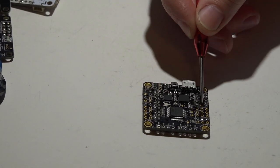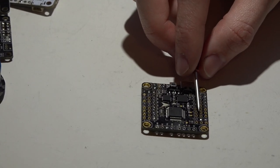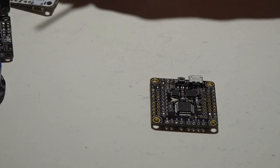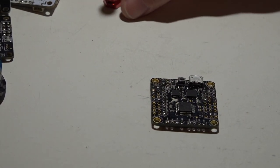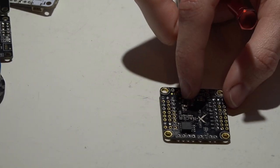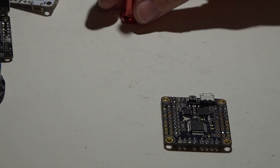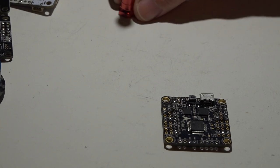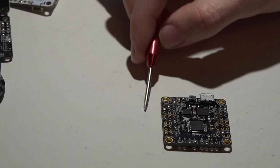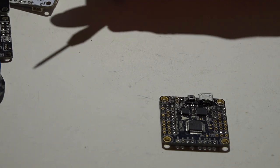But if you have the full battery voltage going into one power pin, it's going to be the full voltage on all power pins. Even though it says '5V' somewhere on the board, that's just telling you to put 5 volts on that pin — it doesn't mean 5 volts is coming out of that pin unless you put 5 volts in. So if your receiver is wired into this, and you're sending it full battery voltage, the receiver's regulator usually can't handle that — and that's what fries your receiver.